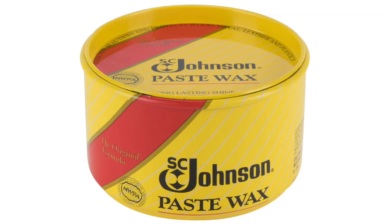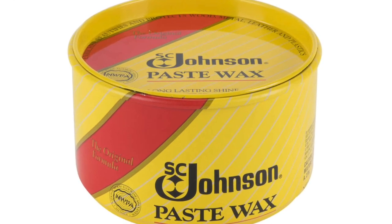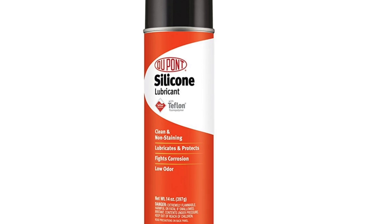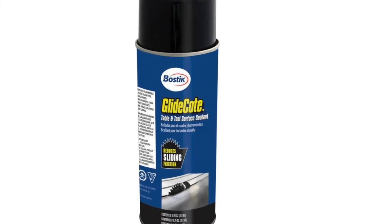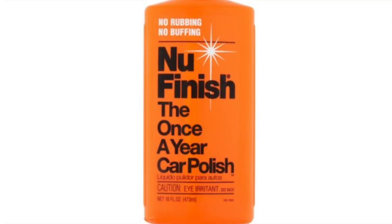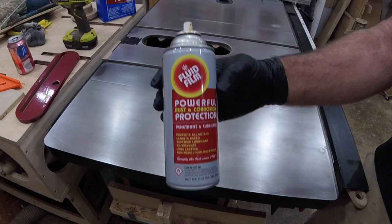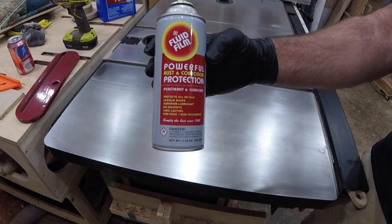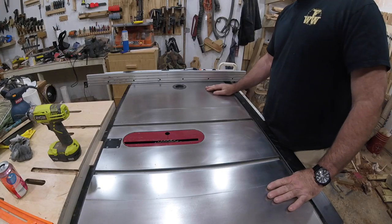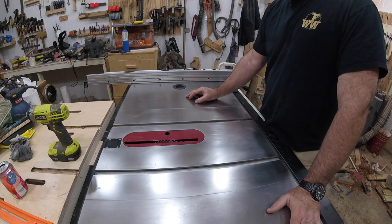So what do I do now? As I said in the earlier videos, paste wax does not work for me. It has to be reapplied very often, and it takes several minutes and a lot of elbow grease for application. I had a ton of recommendations from commenters in my previous videos, and I've tried a lot of them. But the product I settled on and am completely sold on — and keep in mind, these guys are not a sponsor and I get nothing from them — the product is called Fluid Film. It's a lanolin-based lubricant, and it contains no silicone or Teflon. This is my table saw as is. The last time I put this on was about four months ago. Not a hint of rust, and still slick as glass.